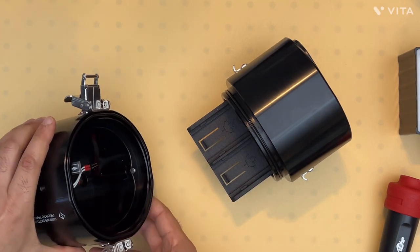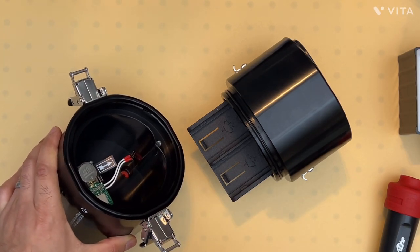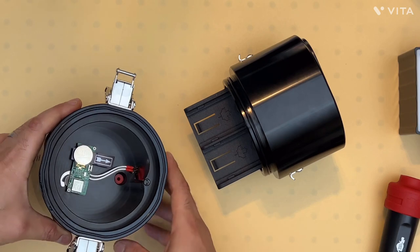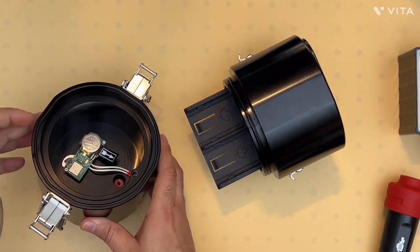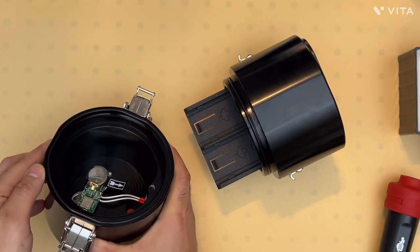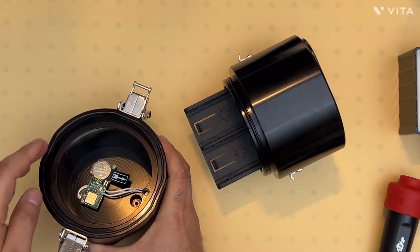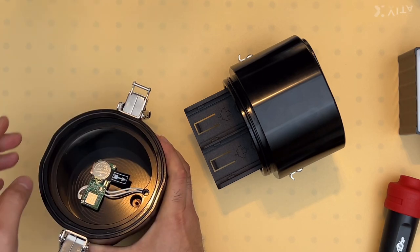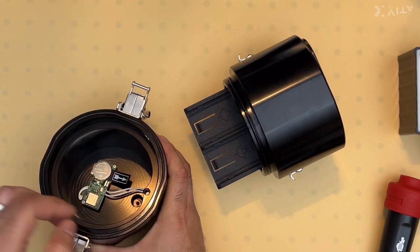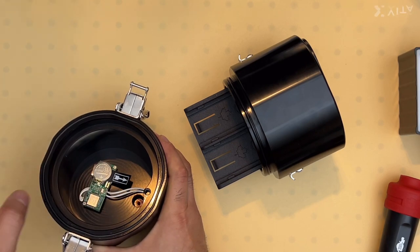You may notice that this particular housing has two O-ring seals — one is radial and one is axial. The two O-ring seals allow you to have dual protection. This half of the housing has a dovetail groove that holds the O-ring. Make sure that this O-ring is clean before you close up the housing — run your finger on it to check for dust, debris, or hair.